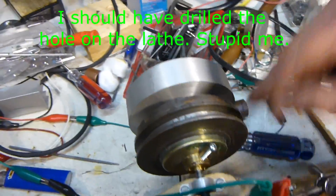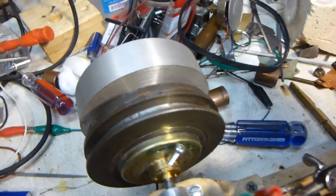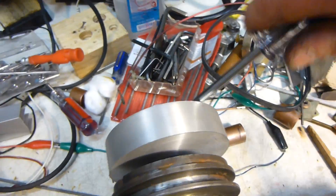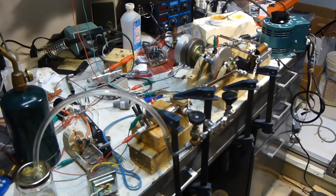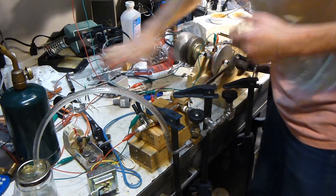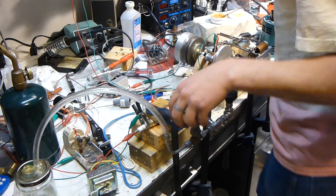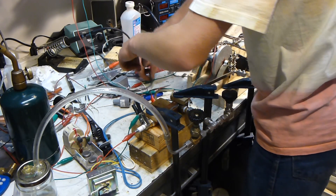I also got the grub screw in there sorted out — the bit broke off in it so I couldn't get it out, so I put a longer screw in there, and now it doesn't spin on there anymore. So let's put that on there — nice and snug. Let's give it another try and see if we can get it working. It's a little bit more flywheel, so it should be able to keep going a little longer. That's pretty close. I'm going to hook this sewing machine motor up again, get it spinning over, get the mixture right, and then we'll see if we can get it going from there.